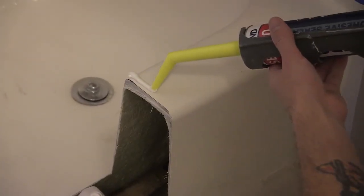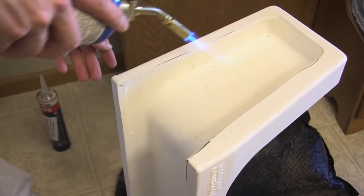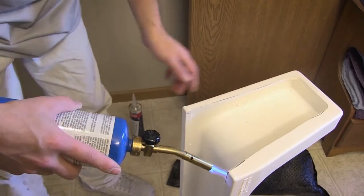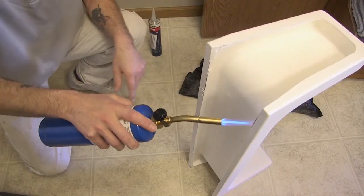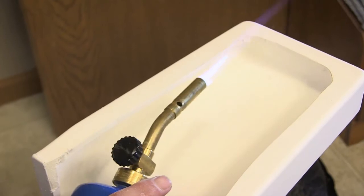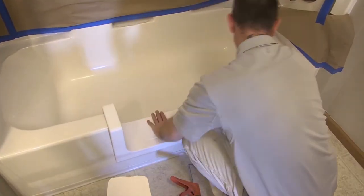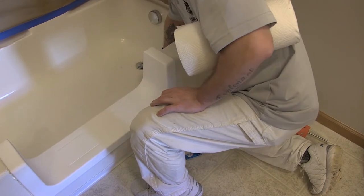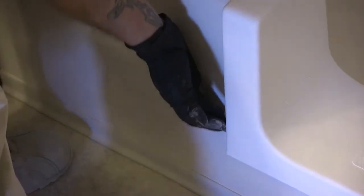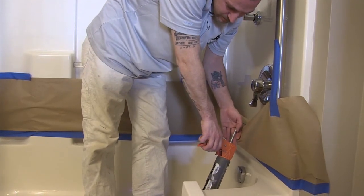Place a substantial bead of adhesive on the top left and right sides of the tub where the SureStep Mono will be seated. Prior to placing the SureStep product onto the tub for the final time, it is necessary to gently pass a low flame several times along the entire perimeter of the SureStep product — this will help promote bonding between the product and the bathtub once adhesive is applied. Use caution when using the torch, ensuring there are no flammable materials nearby and do not hold heat. Thoroughly wipe the tub area with isopropyl alcohol where the adhesive will bond and allow enough time to flash off before applying the adhesive. Do not apply isopropyl alcohol directly on the adhesive as it will prevent curing, and do not use it to clean or smooth your final bead.